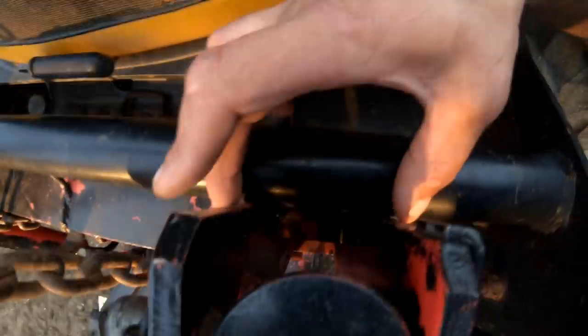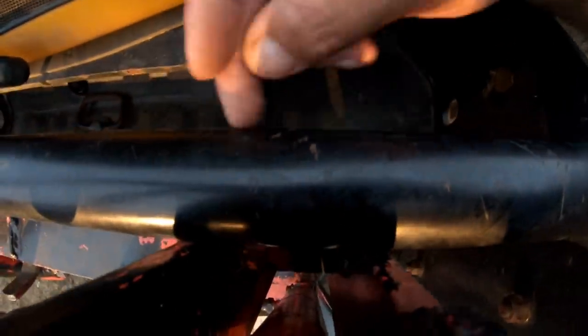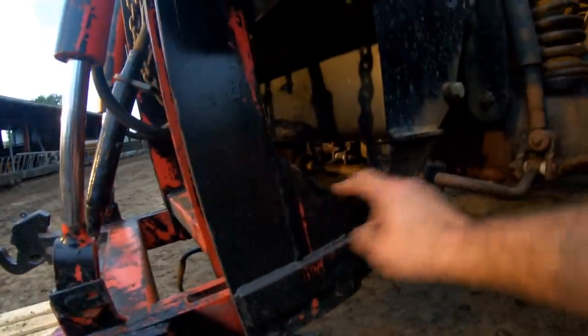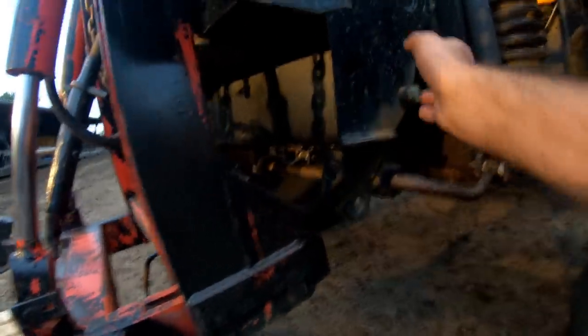Now I've got this top bar here which, at the minute, is not allowing the linkage to sit flush on that bit of steel. I'm struggling with light at the minute. I don't think I've even got to cut all of this tube out — just cut a notch there so that these two bits of steel will slide in. I'll either have to cut the whole way through, or I might be able to leave that bit of back there. Once that sits flush, weld that in on both sides. Then all I've got to do is fix the bottom. I'll probably be able to use some of the frame that came with the linkage to make a bracket, come off these towing eye points here — recovery points. I've got loads of steel there, perfect, to brace this bottom bit. That'll be superb.